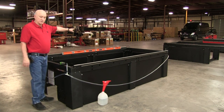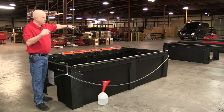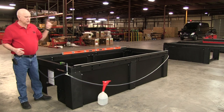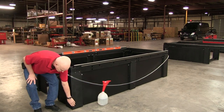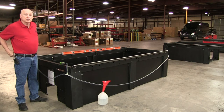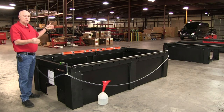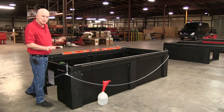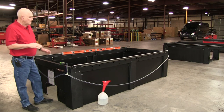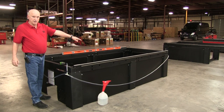So what you're going to do is not adjust that corner at all. You're going to pick the other corners — typically that'll be an opposite corner — and start adjusting using the corner bolts right here, not the ones on the end. Adjust until all four corners show the same water column height, and the frame will be as low to the floor as is humanly possible.